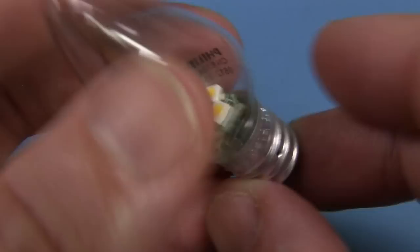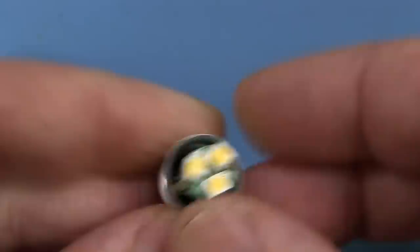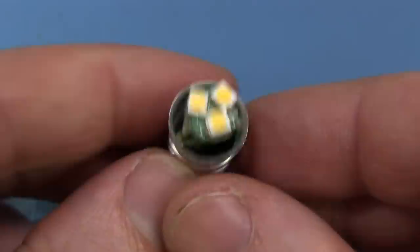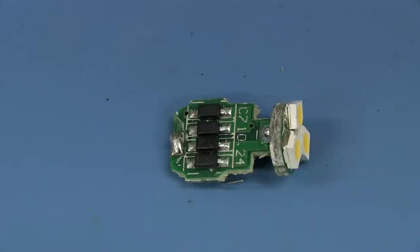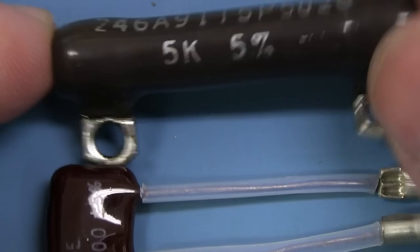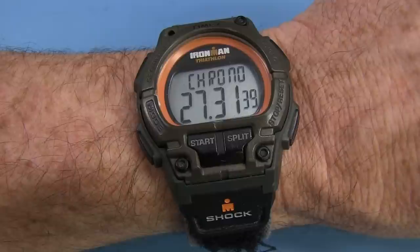We have a Philips LED replacement bulb. We could try and crack it open. It just popped off! Inside there are 4 diodes in a bridge rectifier configuration and some dropper resistors on the back — all bodged on there. No constant current generator. Just 4 diodes, a bridge rectifier, power resistors, and a cap. A terribly unexciting big 5% power resistor. Thank you very much, Lawrence. I wonder what I can spend my George Washington on. Running tally: 27 minutes to do 2 items.